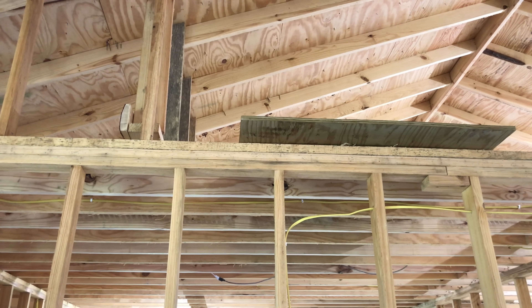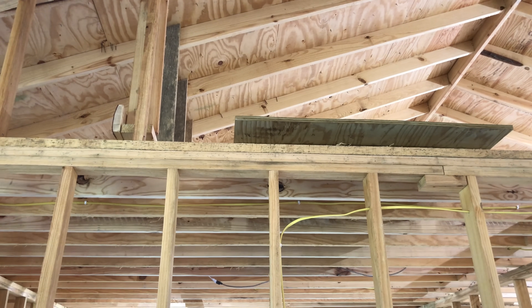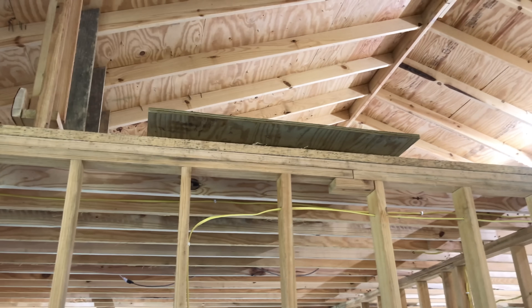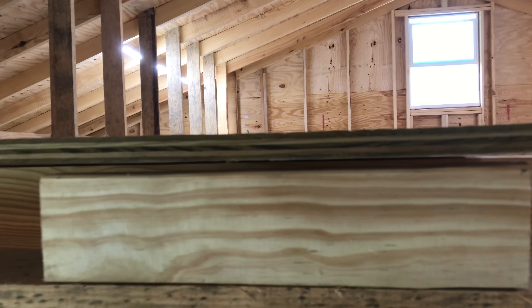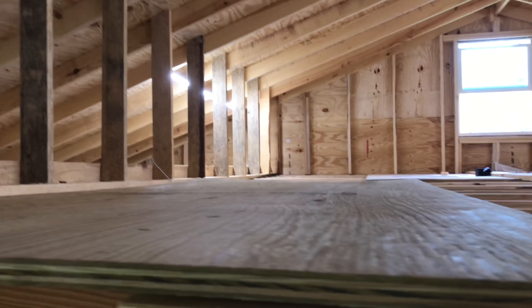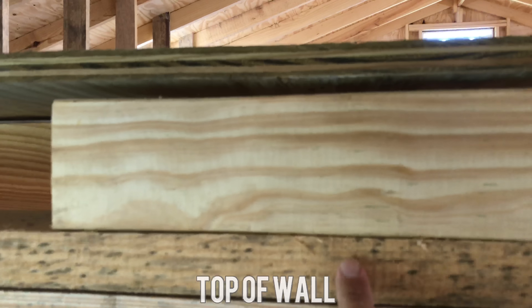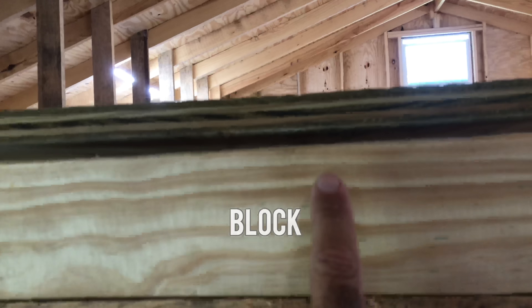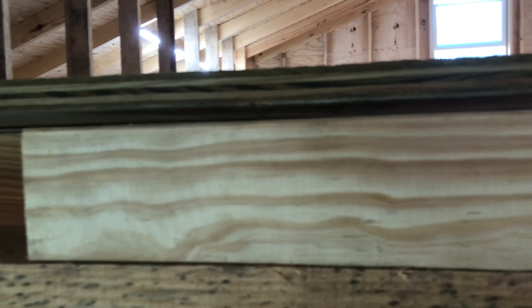Three and a half inches is the exact same dimensions as a two by four on the four-inch side. So I'm going to make an L-shape with a two by six, get that piece put in first, then we can start laying out to start putting in some of this plywood. I just threw this little two by four block in there to show you a representation of what I was talking about — that's going to be the floor level. This is the top of the wall and this is the block that's got to make up the difference. This plywood's got a little bit of a bow to it but it should be perfect.